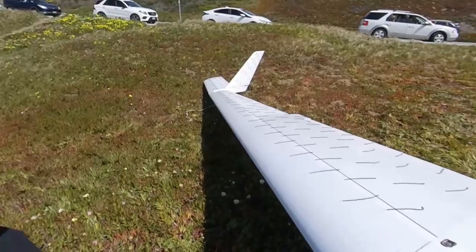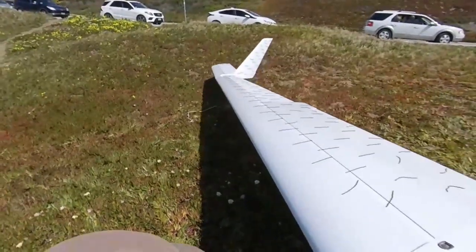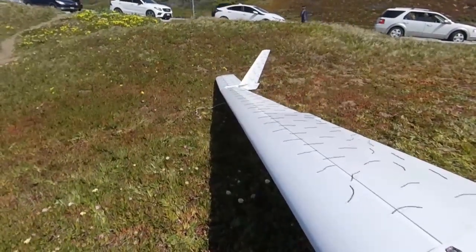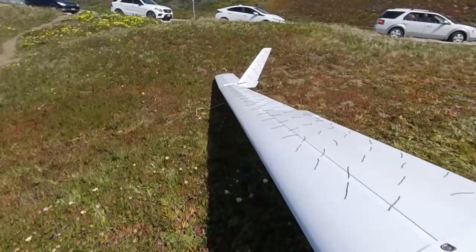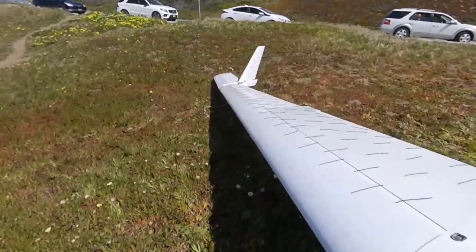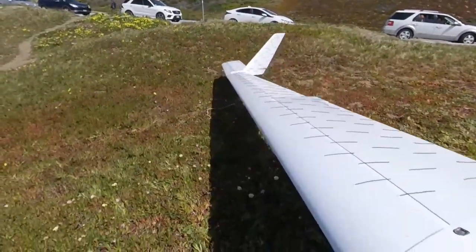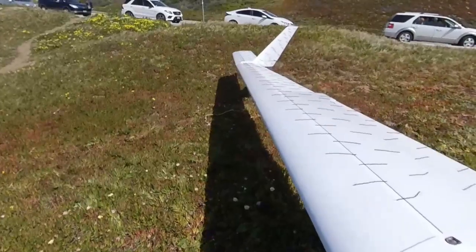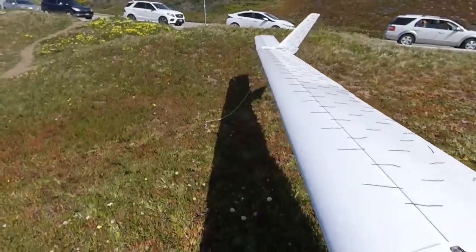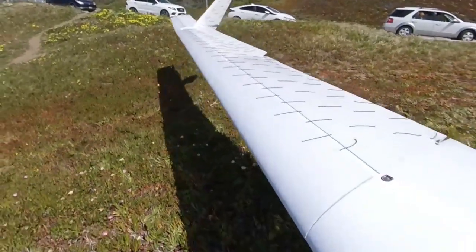You'll see that there's a lot of turbulent condition here near the root section. I need to point out that the glider normally sits on the ground at a fairly generous angle of attack — up around 8 or 9 degrees. We're sitting at the edge of a little hill, so the localized flow conditions have an upward component. As I go to lift the glider and do the initial lift, I'm lifting the nose up, and that's stalling the inboard portion of the wing.